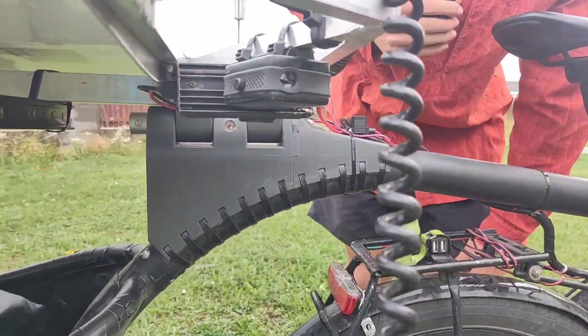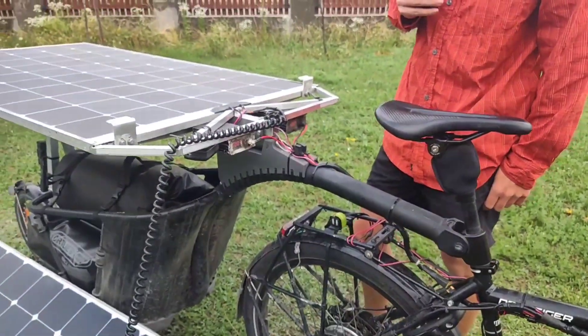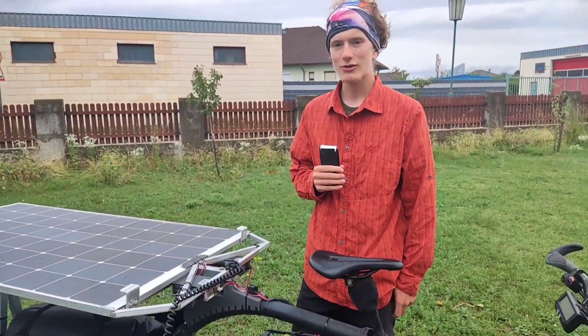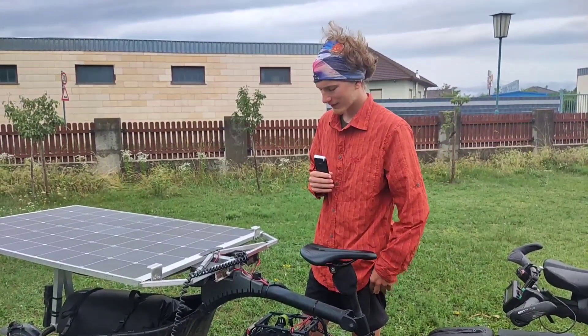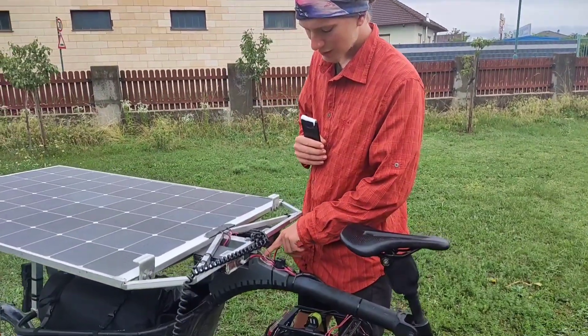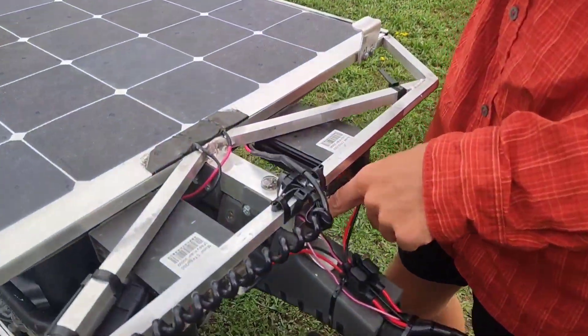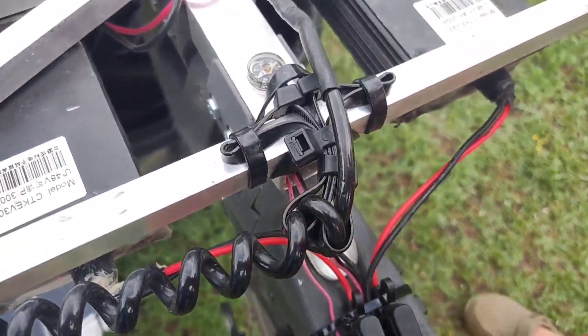In the front we have a big hinge, 3D printed from PETG. We use PETG because it's easy to print with and somewhat heat resistant. We first tried ABS but it's hard to print and warps a lot. This part was so big we needed to split it in two, so we put a dovetail joint in — giving us a nice, big, and stable hinge.